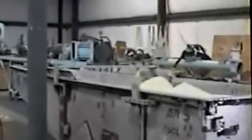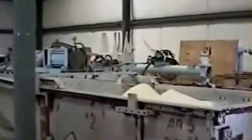Oh, now I know where to get my wing lock holes from. I didn't remember in the carry-through spar. This is the first step right there. This is the leveling. You level that fixture. You locate the spar with an electronic inclinometer to measure degree. See, when the spar is being bent by the vendor, it's supposed to be 5 degrees, plus minus half a degree. Can you imagine half a degree? But it's slightly off. This side overemphasized, looks like this, and the other side maybe like that. So what that fixture does, it does this trick. We measure the same angle on both wings. Then we drill that tooling hole. From then on, I explained before what happened.